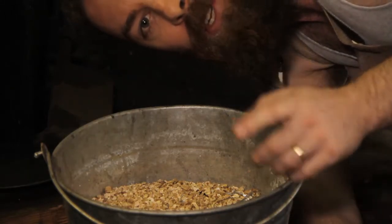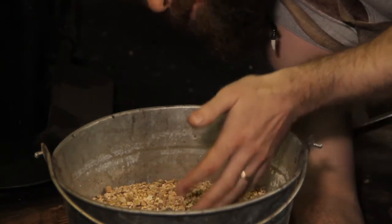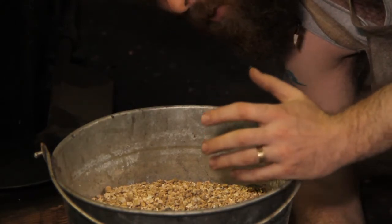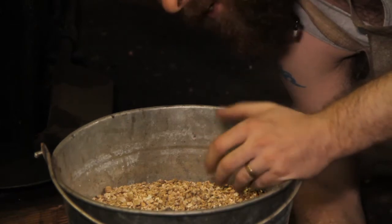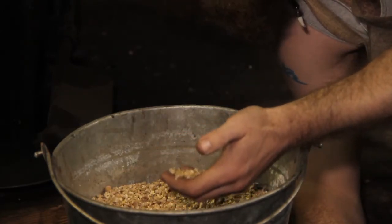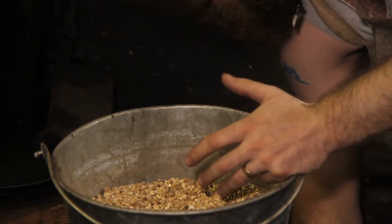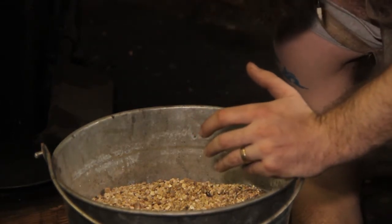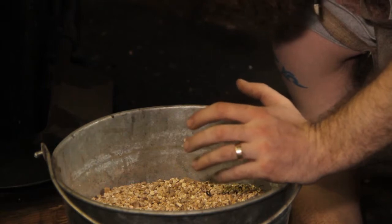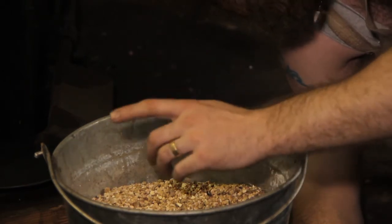If nobody's told you yet, I'd suggest you get a bucket of vermiculite. If you're forging any type of blade, having vermiculite to do a workshop anneal is a really good thing to have, especially if you're going to be drilling through things after the forging. O1 has a tendency to air harden. If I was forging a blade I was going to sell rather than just test pieces, I would go ahead and do a workshop anneal in the vermiculite. It's really cheap, it comes from Bunnings. Heat your blade up to the recommended annealing temperature and get it straight in. Be careful — it'll hold heat for hours after it's in the vermiculite.